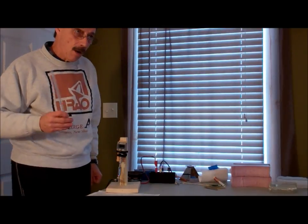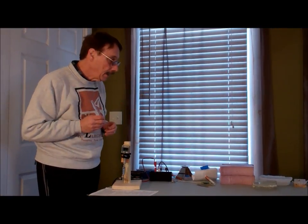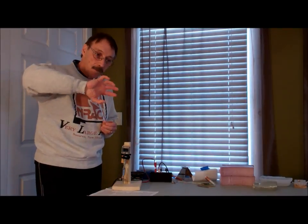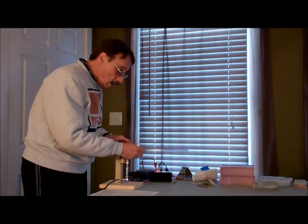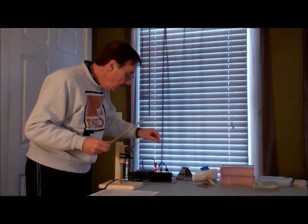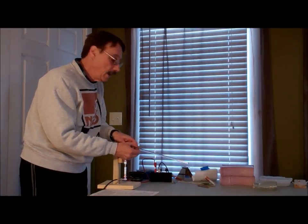And I want to talk about one more type of polarization that we haven't talked about. We talked about linear polarization, where everything's going up and down in straight lines. I want to talk now about circular polarization. And these can be right-handed or left-handed, okay? The ones I have here are left-handed only because it was easier to wind a coil in a left-handed fashion. So, quick review. If I stick this in front, lots of gain. It's a polyrod antenna, but it's still linear polarization.